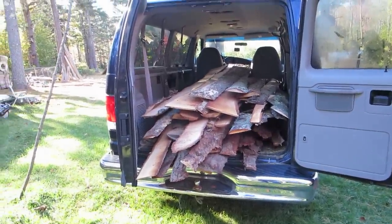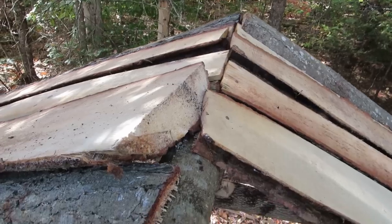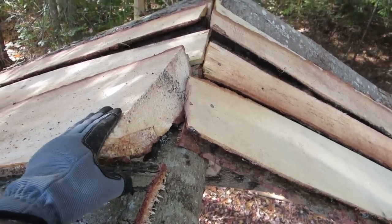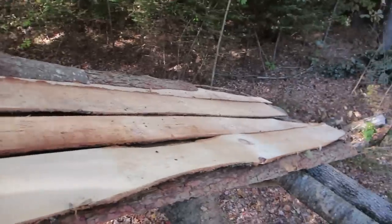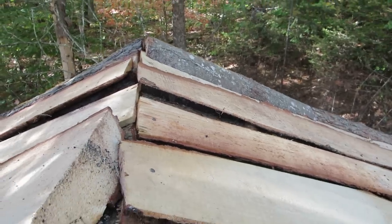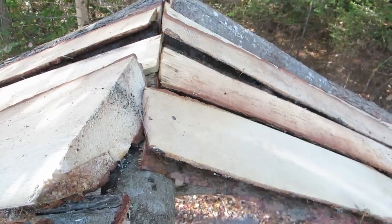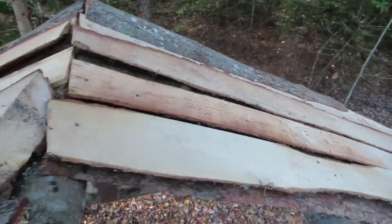Here we are up on the roof. Here's what I've done with the slabs: I put my base layer down with the curve up and left a little space in between, then put my next layer on top with the curve down. The purpose is to create as much of a flat surface for quick water dispersal as possible. I've done that on both sides. There are a few spots where water may be able to get in — it's not going to be 100% waterproof. I may try to cap a couple of those, and then I'll lay a board across the top as a cap.